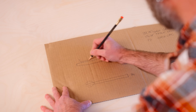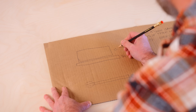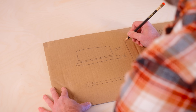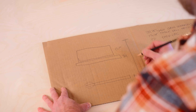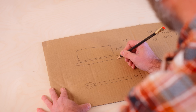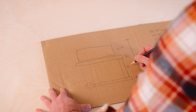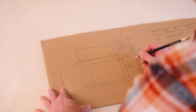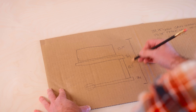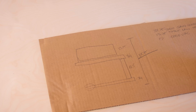The table saw itself is 13.75 inches tall. I want all of this to total 34.75 inches, which means these legs right here are 18.5 inches. So: one inch, plus three-quarters of an inch, plus 18.5 inches, plus three-quarters of an inch, plus 13.75 equals 34.75.